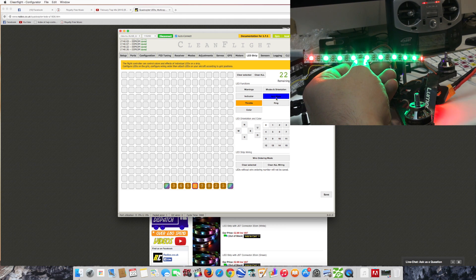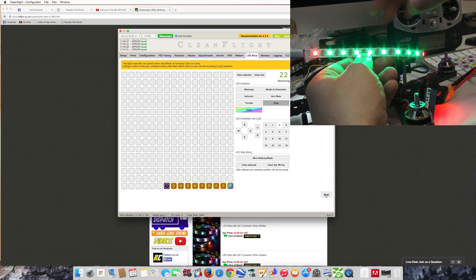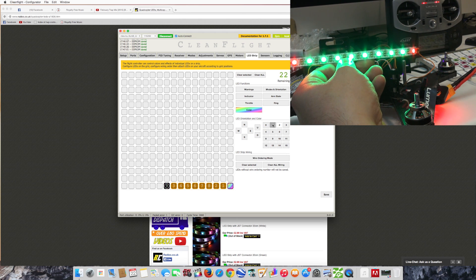So that's very simple. There's so much more that you can do with these. I'm going to go into these two LEDs on the outside and use these for reference. I can select ring and press save. So now, when I'm armed, you can see that it's actually flashing. And when my throttle goes up, you'll see that the flashing changes too. And disarm again. So when you select ring, it actually means that the LED is going to flash. You can configure all of these to flash if you want to - individual ones and to what color you choose as well.